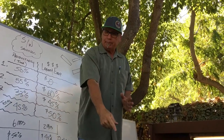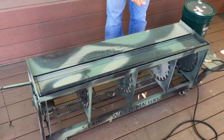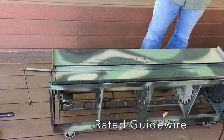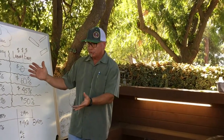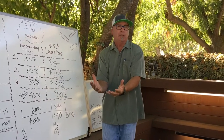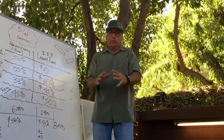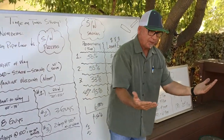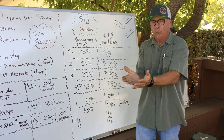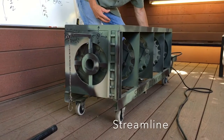So you don't actually have to get up on top. You can climb up here, walk up and down the top, grab your lanyard from your harness, clip it on a guide wire that's rated — so you've got fall protection and help guide these pipes down in the slot. Rotate the distributor wheel, guide the next one down, rotate until the whole thing is completely loaded. Also, in between these distributor wheels there's a locking mechanism that'll block and slide over the top of the conveyor so you can continually load without worrying about that opening at the bottom — the pipe will hit the block and there won't be access to the discharge conveyor.